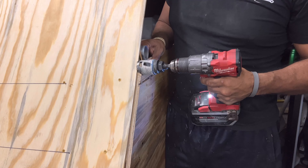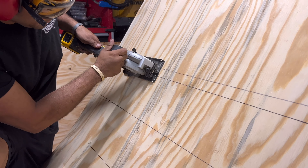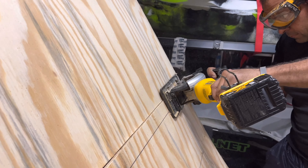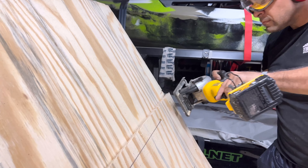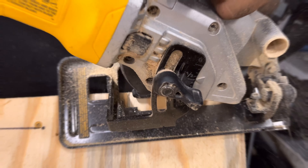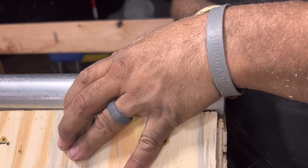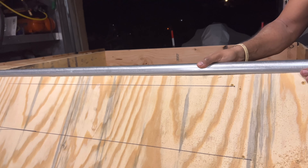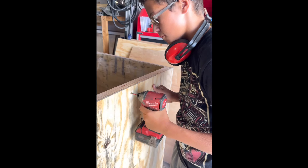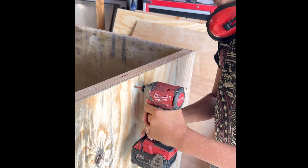For the coping, that was a little more tedious. We used a hole saw with an inch-and-a-half bore to cut an inch-and-a-half slot on each side. You have to cut it at an angle — I found out cutting it straight did not work, so you have to taper the circular saw all the way to the left to make the angle congruent with the circular cutout. It should slide in and meet the other side if the holes are correct. The top piece also needs the exact same beveled cut mirroring the bottom to fit over the coping. My son got his hands dirty in the project — he's finally 14, which is the legal age to be on YouTube, so he can be on air now.